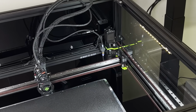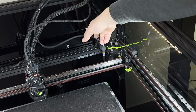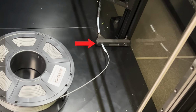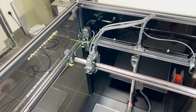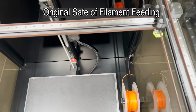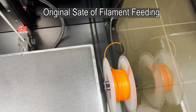To address this issue, I redesigned the corresponding part to use a coupler for 6mm PTFE tubes to relieve strain at the critical position. Additionally, I added a reverse Bowden filament guide to the filament holder at the bottom to improve filament feeding convenience when crawling on the floor. Links to the printable files below. These were the only significant flaws I encountered during my experience with the ready-built VCore 4. However, drag remains rather high on that 3.5 meter PTFE filament feeding.